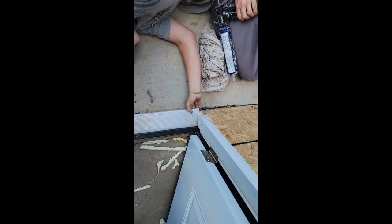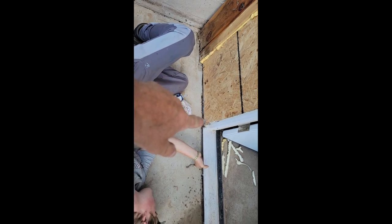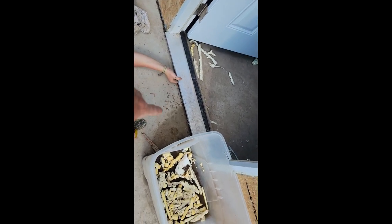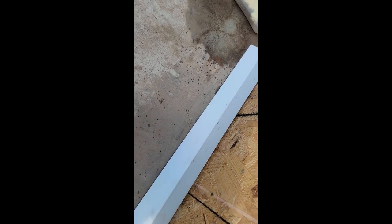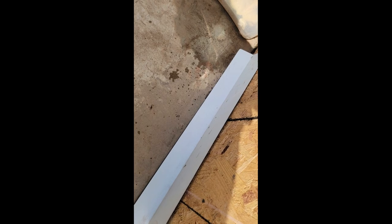Dawson's using through-the-roof caulk — that's our second barrier against water. We've got the sill gasket and the treated plate. We kept the sheathing up so it can't get wet. Now he's making sure he gets a layer of that caulk under the door — hard to reach — and then he'll clean off the excess. Then we're going to do some flashing with a bend on it. Instead of it being flat against the ground, we'll push down on it so the water wicks away and we'll run the paper over top of that.